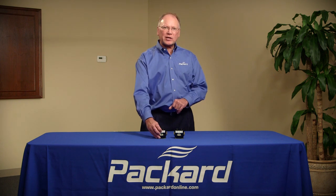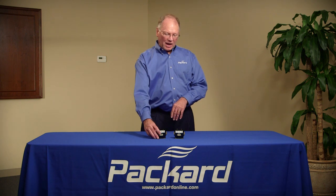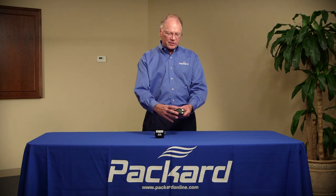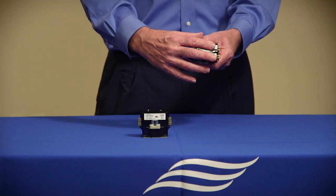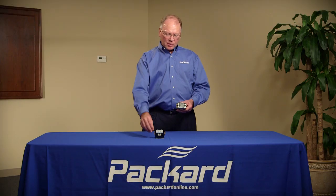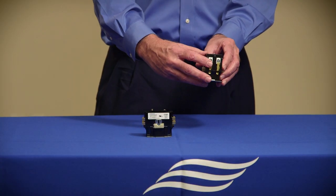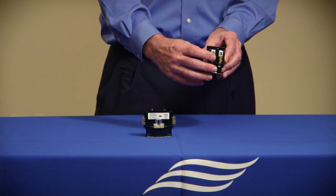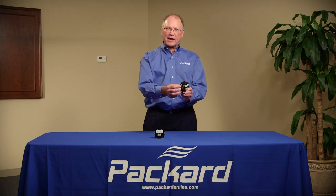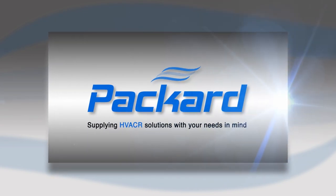Now some people wonder: can you use a two-pole to replace a single-pole contactor? If I have a shunt on that single pole, when I use a two-pole contactor to replace it, I'm breaking both legs across these contacts. What I had connected on the shunt side now has to be connected on the very same terminals so that my load is always hot on this side of that contactor.